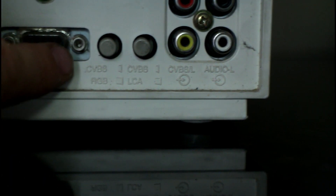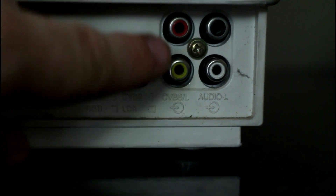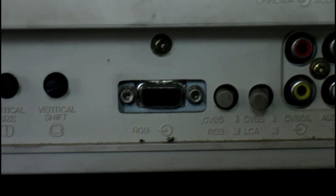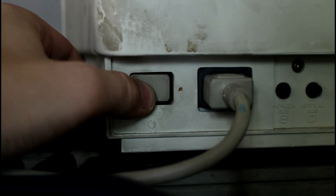There's a manual that shows you how to switch inputs. Hopefully the RGB works — I don't have a way to test it yet. Here's what the luma/chroma cord looks like: it basically splits into two RCA jacks — nothing fancy. I use nice shielded ones. There's the S-video end, and it just splits the luma and chroma from the S-video signal into two separate RCA sources that go into the monitor. For RGB it's a little different — I need to get a seven-pin connector to BNC, and then I can go from SCART to BNC from the consoles.